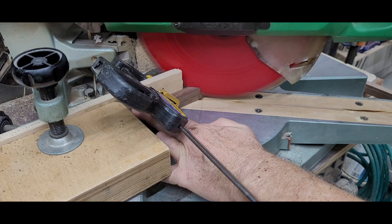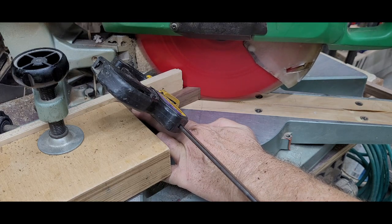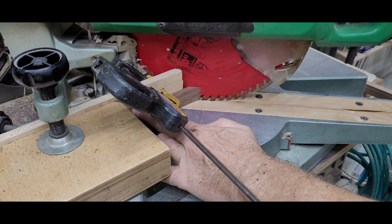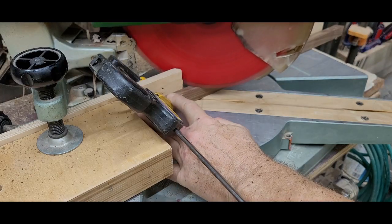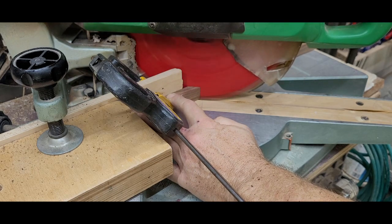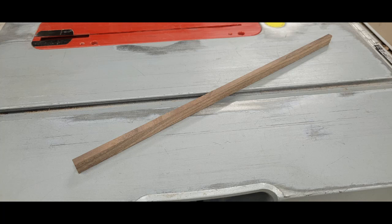box. Then I did it all over again, but this time with 3/4 inch by 3/8 stock, because I miscalculated the space I needed there. Oh well. The two dividers are 3/4 by 1/4 inch, and I could have easily cut just a couple of simple dados for them to nest into, but why make things easy?